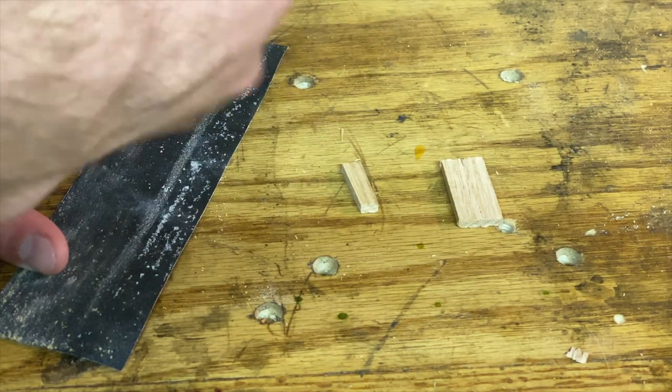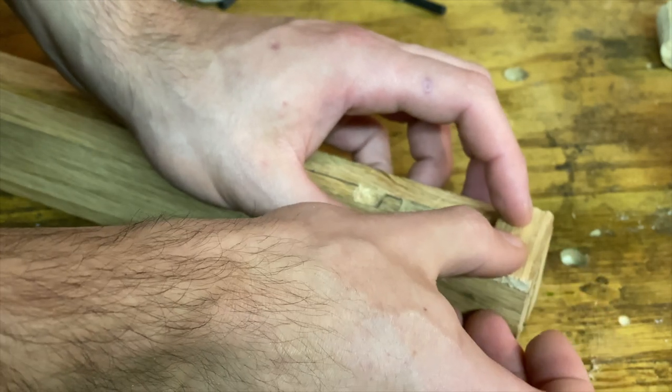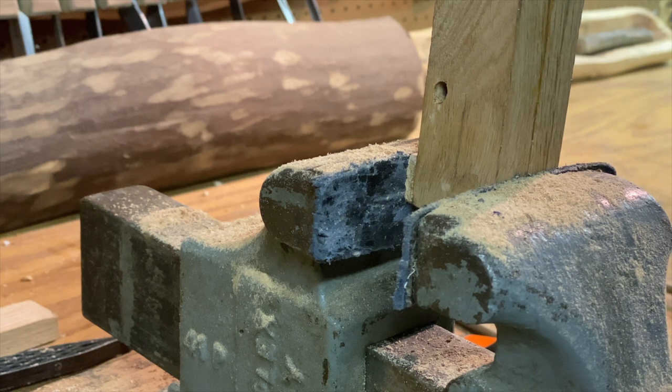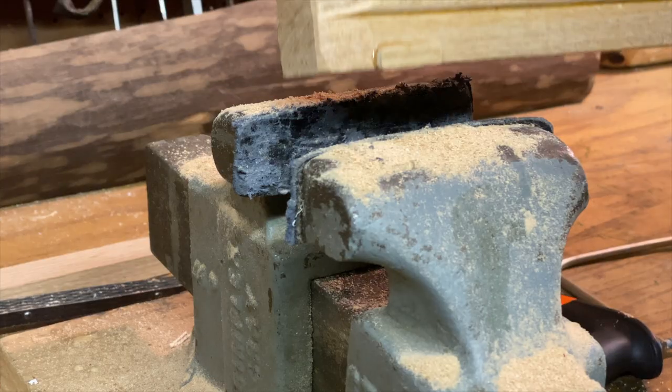It's hard to get the sides of the string slot smooth, but this is taken care of automatically if you just use the sides of the board, and create the space by using spacers. There are three spacers total, a wide one in the back, and two narrower ones in the front. Keep the front ones narrow and wide enough apart so that the bolt can still fit between them with a little bit of room to spare.